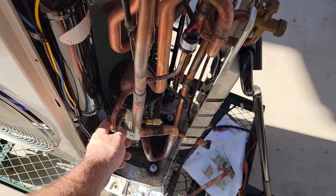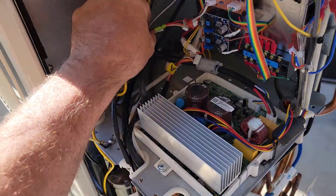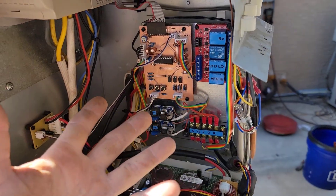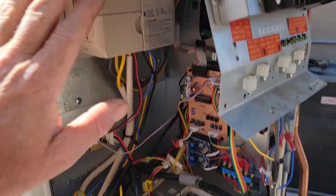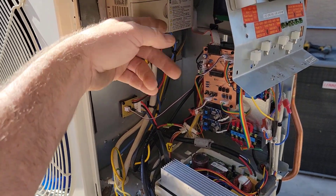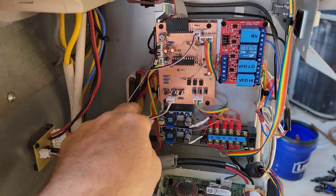The compressor is a new takeoff of something else, so hopefully it's good. My stepper motors I put in last week for the heating, I'll just leave them disconnected - I'm gonna make a controller later for them so I don't have to worry about heat till next year. Really none of this stuff is that critical because in that unit I'm doing the exact same thing: same variable frequency drive, same compressor. The 24 volts AC from the thermostat latches two relays to do the 40 Hz/60 Hz step for the digital inputs. This board just adds a delay, I have a low pressure switch interface through it, and display stuff like that.